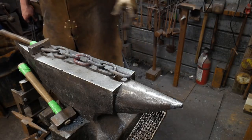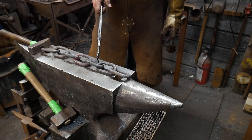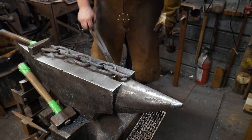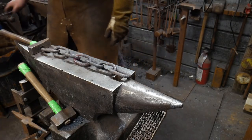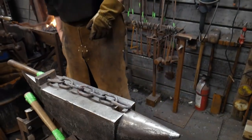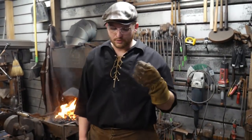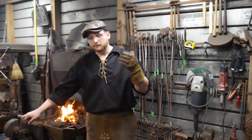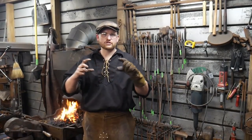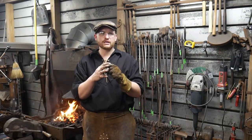So now there's a way you can cheat 100 foot of chain. You can make each one of these loops excessively long, like 6 inches long. So you make really long chain lengths. But the secret about chain, go ahead and back it out, please. Thank you. The secret to chain, or from what I have understood of good chain, it's usually short, stout links. The smaller and stouter you can make a link, the stronger the chain.